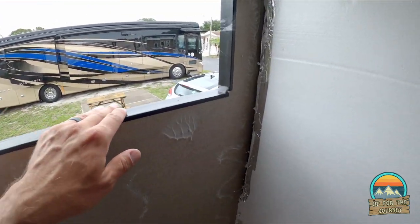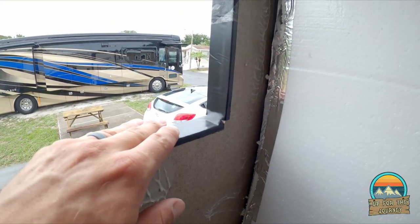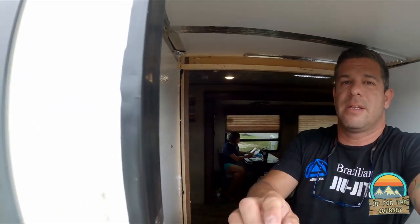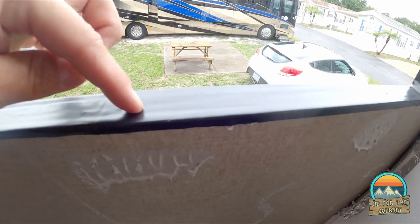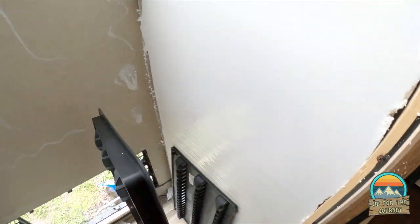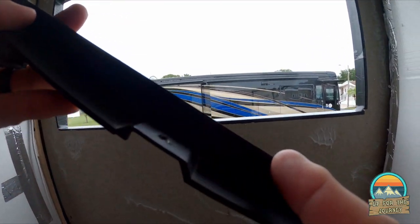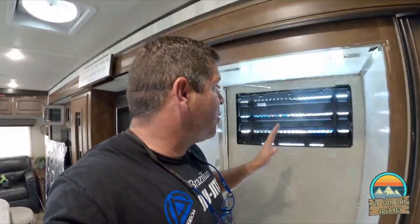What we decided to do was remove the frame and wrap flex seal tape around it, just to create a seal so water doesn't get in between the wood and everything else. We're still going to put the frame in, but we'll put a huge bead of silicone right here to make it seal tight — like they do with windows — and we'll do the same thing to the bottom so the grates are caulked and sealed.